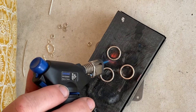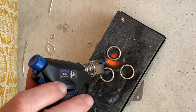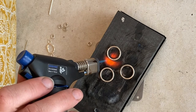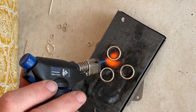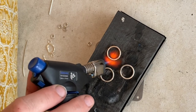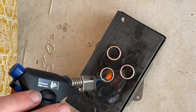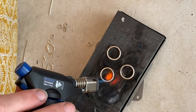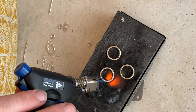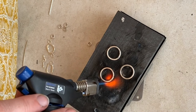This one I can't actually see a join at all, which makes me think it did fuse all the way through. But I will just heat it up just to be sure. It's great when you can't actually tell — I'm looking at this really closely and I can't tell where it is. Just up to temperature and surface of the metal wet, and the same on this one. I think the join is there, and this isn't just being said for demonstration purposes. It is great when you can't see where the joint is. You can see it's looking wet and there we go.